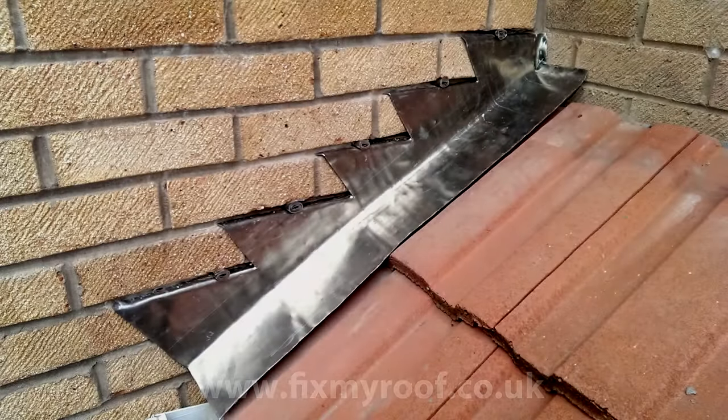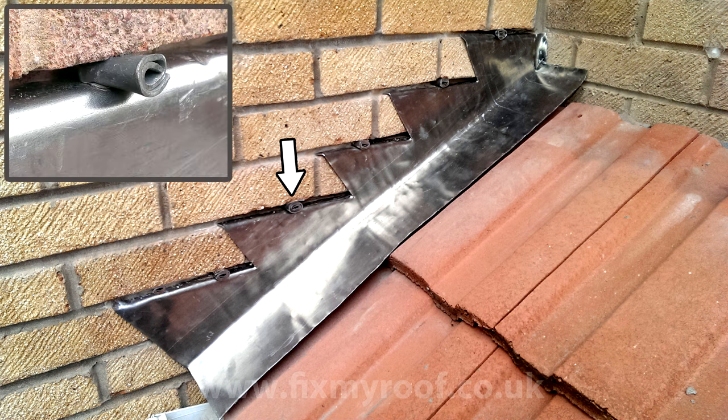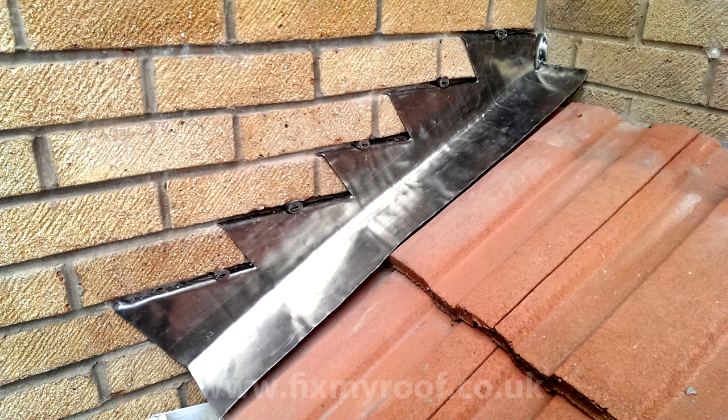Now the lead flashing is slotted into place and I have fixed it with traditional lead chock fixings. And if you don't know how to fit these or point up a mortar chase properly, please check out my other video on how to fit lead flashings via the link in the description bar or at the end of the video. I have also taken the opportunity to trim off any unnecessary lead here to make things not only look a little neater but also to help the lead dress better at the end.